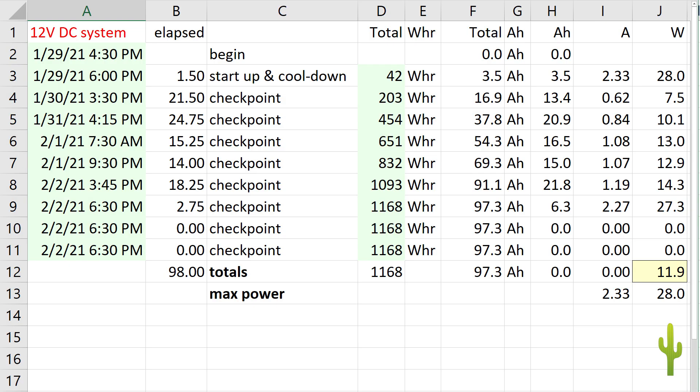Now let's look at device power logging. Although you can get power requirements from device manuals or manufacturer websites, these don't tend to be too useful as they include safety margins and fudge factors, and will almost certainly overstate the real power the devices use. For instance, the manual for the dual power fridge freezer I purchased for testing stated that it required 85 watts of power. The measured reality was that it used no more than 50 watts at full load during initial cool down, and then averaged roughly 12 watts after reaching operating temperature. If I'd used the 85 watt value from the manual, the design would have demanded six times as many batteries and solar panels, adding thousands to the projected cost. I suggest you measure your device across at least a few days and use the real world results for your design work.